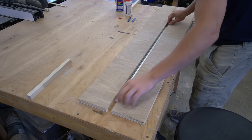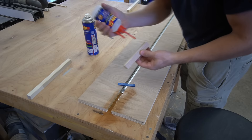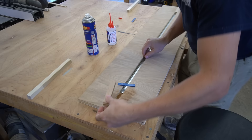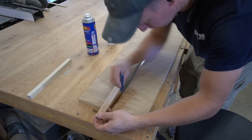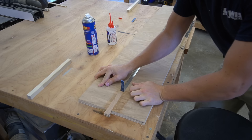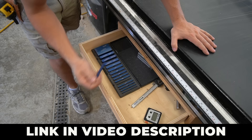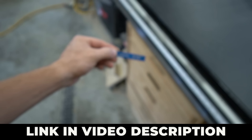To get the length of the slot on your jig, use the same principles — simply put your aluminum channel in your jig and use your offset block. In this case I actually went three-sixteenths to give me a little extra space. I'll use CA glue, which is absolutely amazing for making jigs — it dries instantly and you don't have to use any nails or fasteners. I'm using my offset gauge setup blocks; they're absolutely amazing to have around the shop and I cannot recommend them highly enough.